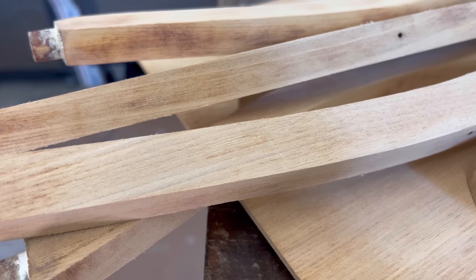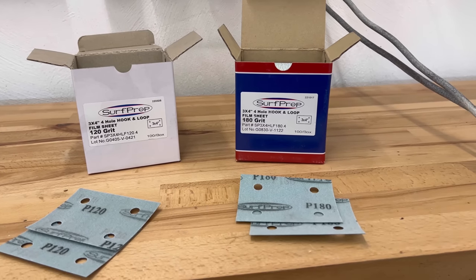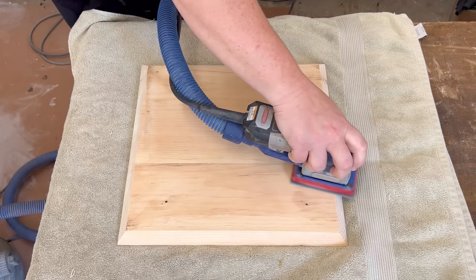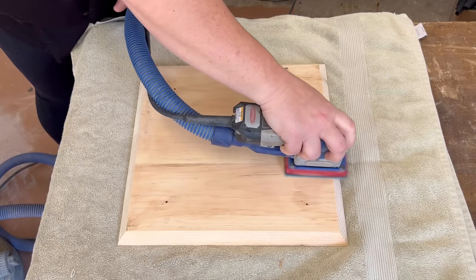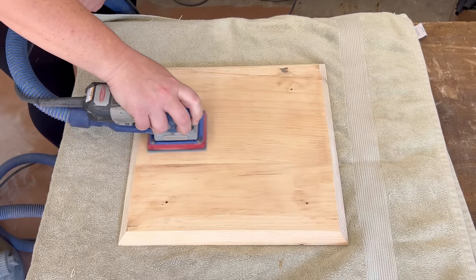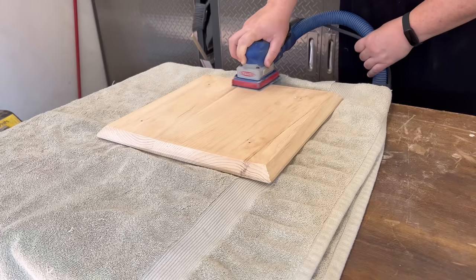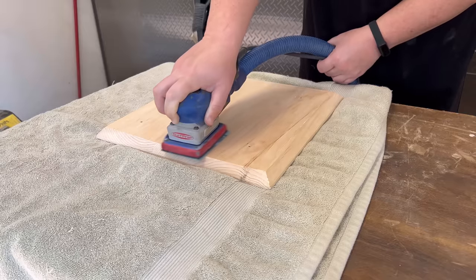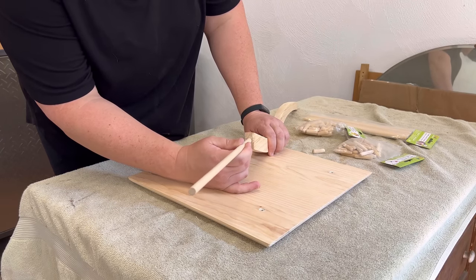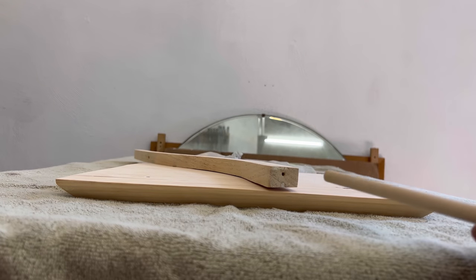Two naked tables, but I was nowhere near finished with sanding. The 80-grit paper will leave your wood feeling quite rough and kind of fuzzy, so I needed to go back over every piece with slightly finer 120-grit and then finally some 180-grit to gradually smooth out the surfaces and close down the grain. I put an old towel down on my workbench so I wasn't scratching up one side while trying to smooth out the other. These are both pretty soft woods and they'll dent or scratch really easily. I worked my way around both tables with the finer grits, buffing out any swirls the 80-grit might have left, and then I had to figure out how I wanted to put them back together. I went to my drawer of dollar store craft dowels and decided to use quarter-inch round dowels on the table that had the screws through the top.